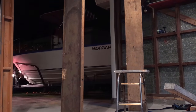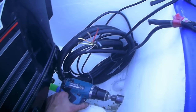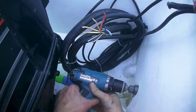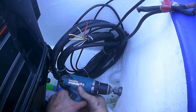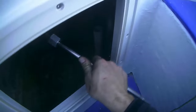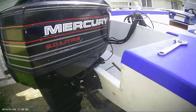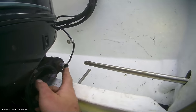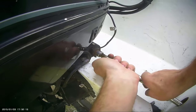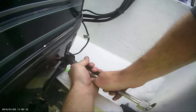With the motor installed on the boat I can drill the hole where the steering cable would run through. Now it's just a case of putting the steering cable through the hole and getting it going out the back. Remember to put some grease into the hole that the steering arm will go into and onto the steering arm itself - this just makes it easier and slides in a lot easier this way.